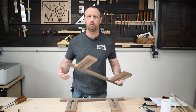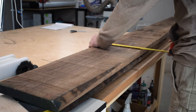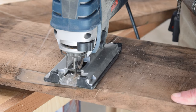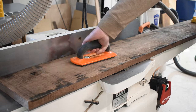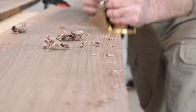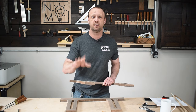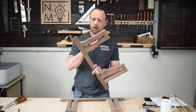I let my shelves dry overnight and then did a little sanding on the surface to get rid of any dry glue. Now it's time to work on the shelves. The other day I picked out some walnut that I really liked and went ahead and rough-milled it down. I didn't mill it to final size because I wanted it to acclimate to the shop and because I didn't know exactly how thick I wanted it — I wanted to make the brackets first, then determine the shelf thickness that slides into the bracket slots. Now that the brackets are complete, I'm going to finish milling up those shelves to their final size.